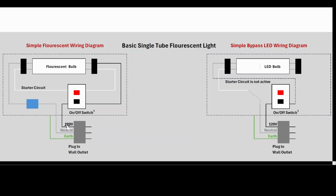I also went back and shot some additional footage where I was able to correct the error in certain parts, but I wasn't able to completely reshoot all the video. So just keep that in mind. The red, yellow, and brown wires in the lamp are the neutral side of the circuit, and the black wire is the 120 volt lead in the circuit.